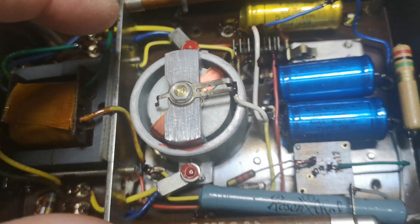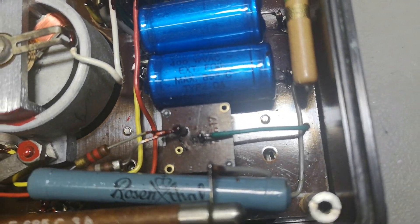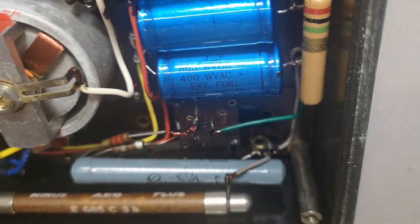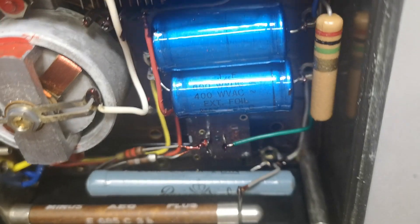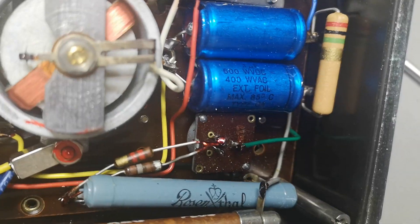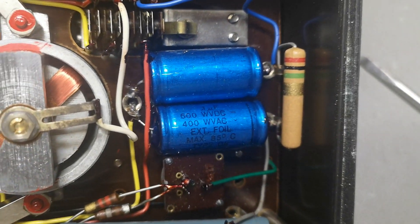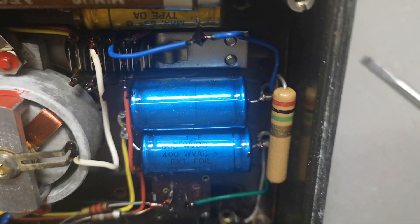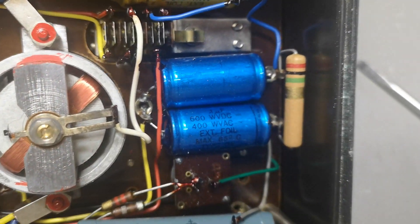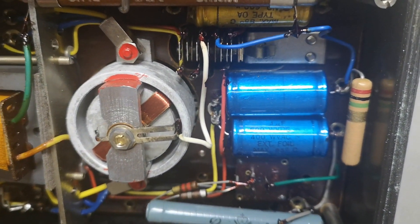The windings on the transformer — that is the self-oscillator circuit. It generates a high DC voltage. We've got some capacitors here rated at only 400 volts — so how is it running at 1200 volts? That is a little bit confusing.